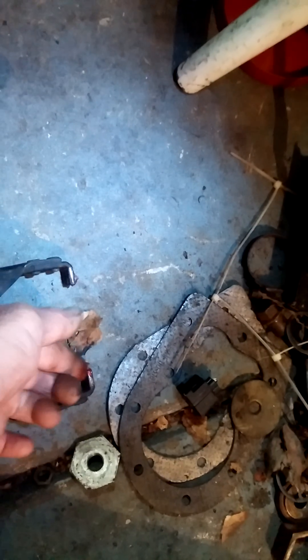Separate them out a little bit, then take your fork arm and make sure that this is facing toward the front of the tractor, away from the clutch mechanism. Put a little dab of grease - just a little, not a lot, because these are going to be dust magnets. Put it on the ends here on both sides, just a little bit. If you put too much, it's just going to attract dust and create problems. So then you pull this out, put your clutch fork in the cam, and put the other cam on.